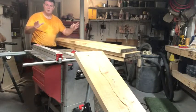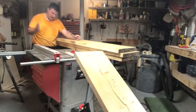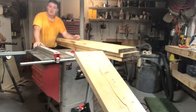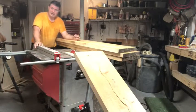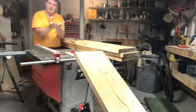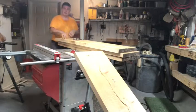I don't know if you can see — my table saw was actually walking a little bit, and that's one of the problems of having a small workshop. I have to have the table saw on a cart so that I can move it, but the problem is that periodically it'll start walking a little bit, and what that did was put a wave in that cut. So instead of running it through the jointer once, I may have to run it through three times to take care of that little walk, because when I glue the planks together, I want that edge to be perfect so that it butts right up against the other edge. When I do that, I'll glue it together with biscuits, and we'll see that here in a little bit. I'm going to go ahead and do the rest of these.